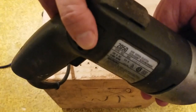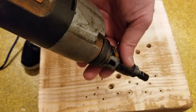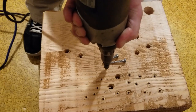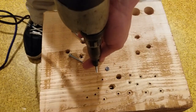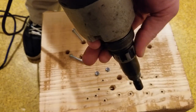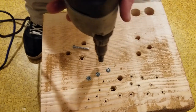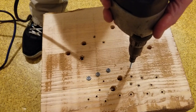Here we have the Black & Decker Industrial 2050 — the current equivalent would be something like the DeWalt TW266. It has a different kind of base adjustment setting — this is the high-torque one, a 5-amp motor with triple reduction at 900 RPM. These are the institution — the Black & Deckers, the DeWalts. Just the way they fine-tune the way the clutch operates and how easy it is to adjust. If I think it's a little bit light, I can just twist it until it snaps in the next position — that easy. My next fastener goes a little deeper, I can go right back over and it's not really that noisy and doesn't vibrate a ton in your hand. These things seem to be able to drive tens of thousands of fasteners.